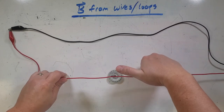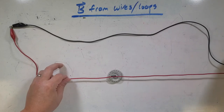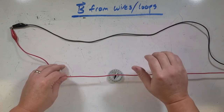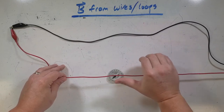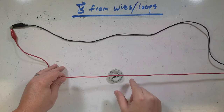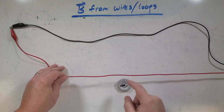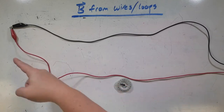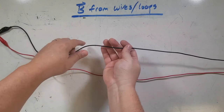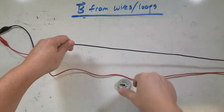So under the wire, I put my fingers under the wire, and you can see they're pointing down, and so when I turn the power on, the field points down. What about on top of the wire? Thumb pointing this way, wrap it around, and my fingers point that way, so the compass moves that way — that's the direction of the field. What about over here? Current's coming this way, comes back around. Right-hand rule: thumb points this way, so on top of the wire, my field should point down.